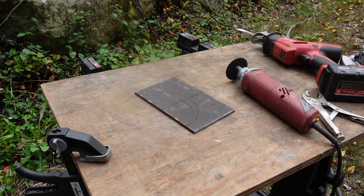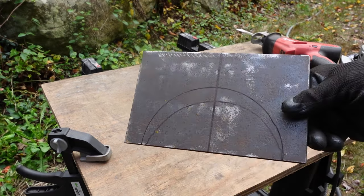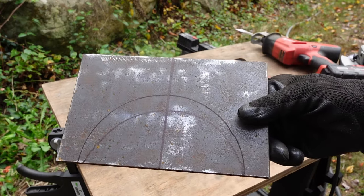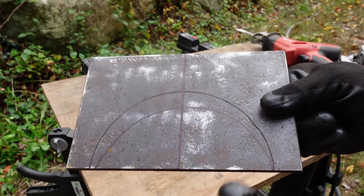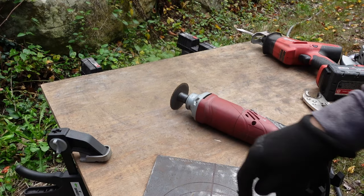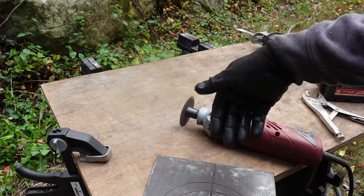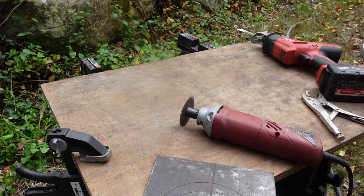Beautiful fall day out here. I made another circle — this one on the outside — using the gasket instead of the contour gauge this time. It gives a much better half circle. I just traced the inside diameter of the gasket because that's where I want this to meet up, not the outside. I'm taking a cutoff wheel and slowly working my way around. It's not a straight cut because the cutoff wheel gets too big, so it kind of bevels. I'll have to go around and square it up with the angle grinder. I've got a sawzall too to try to cheat a little bit — otherwise it's just a long and lengthy process to cut the half moon out.